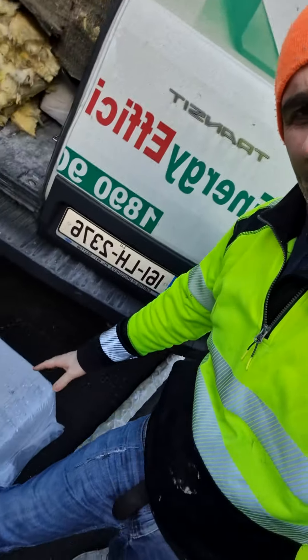For the front porch — open it up, take it out, if there is anything in there get the good stuff in. We're going to do one layer of polyurethane high-density moisture-proof. You'll see a lot of people getting spray foam systems up in the roofs but the moisture is still going through the building fabric and up into that space and condensating. So VCL and insulation all in one — high-density polyurethane — and we'll go on top of that with cellulose insulation from the bags, just opened up and spread on top.